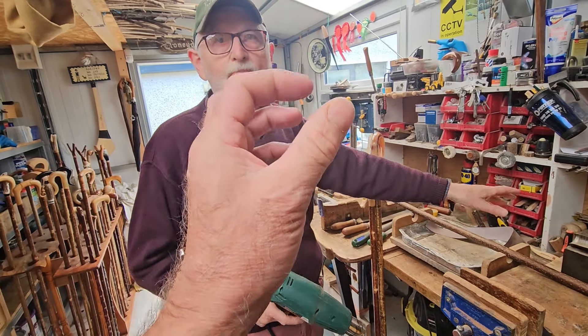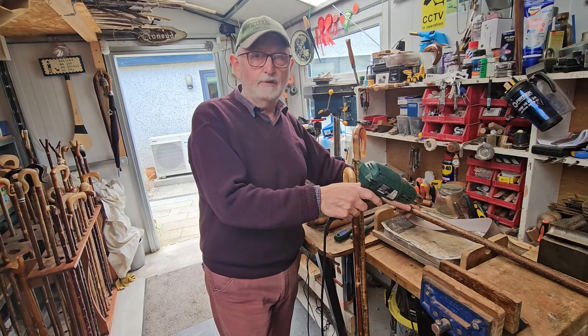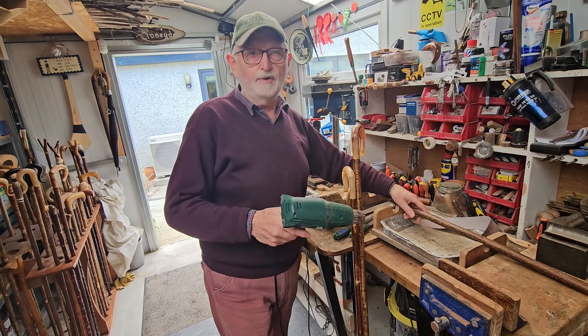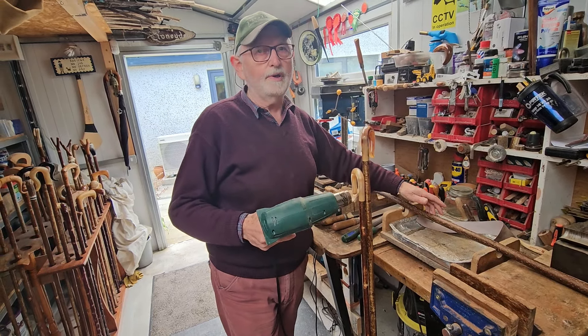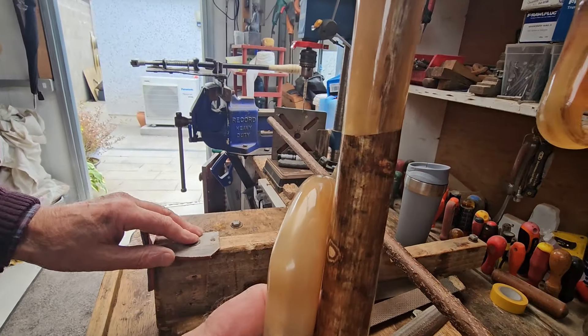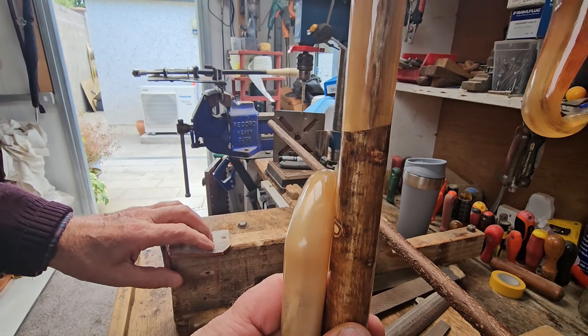Because it'll fit the size of the horn - it has to stay like that. You like the horn to suit the stick. And you don't want it to dry or change over a period of time. So if it's dry and well aired, nice and slow, about two years. Never work on one year's wood - it has to be two years drying. So that giant piece then has to be perfect - you couldn't have that timber shrinking in six months' time.